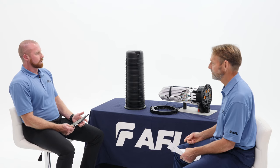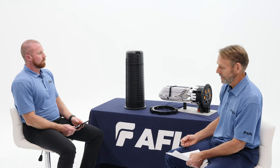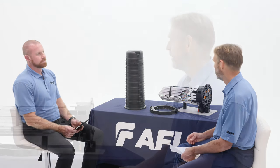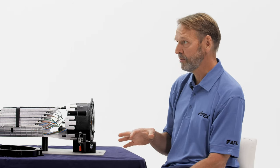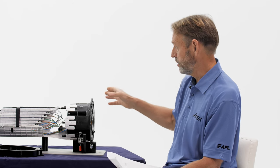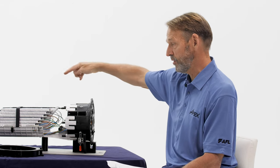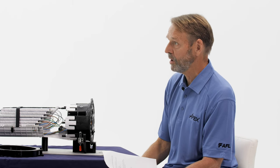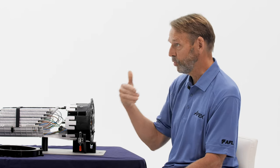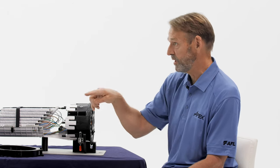As we've seen with a lot of different cable technologies out there, such as AFL's Wrapping Tube Cable, fiber counts have been increasing exponentially over the past few years. What things did we do in the Apex closure specifically to address those high fiber counts? We definitely took wrapping tube cable as one of the things we kept in mind while designing this closure. The integrated basket is a very nice method to route large-count cables up through and transition onto the trays very nicely and easily. The trays themselves also, with wrapping tube cable, lend themselves to having multiple ribbons or ribbon splices on one tray. The fiber lays very nicely in the trays.